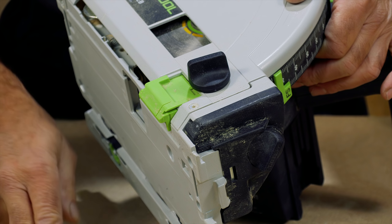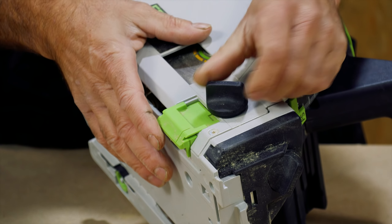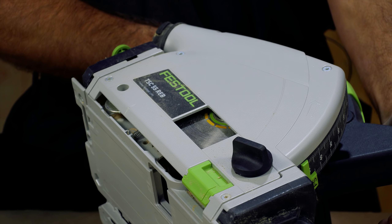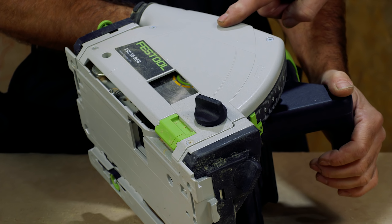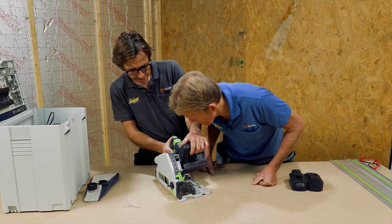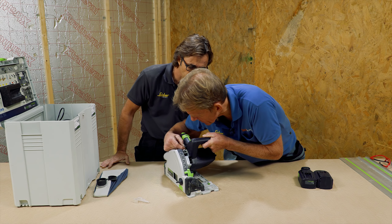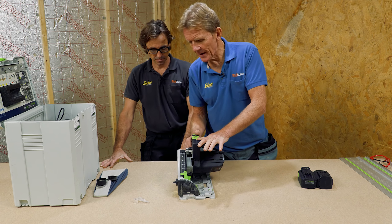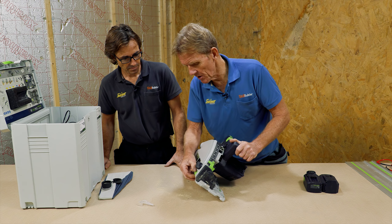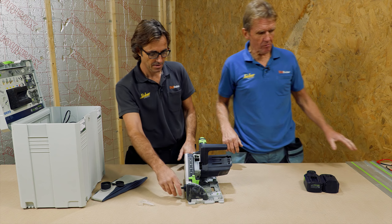There's a splinter guard here - you can take out the vision panel and replace it with this splinter guard, which does a couple of things. Obviously it does what it says on the tin - it guards against splinters. There's another knob which just secures it. When you're on the rail, you can pull that down and it's actually helping you protect both edges of the cut - one that's against the rail and the one that's not. Also it's going to stop your tipping as well. If you've got something you really care about, like a veneered door, and you're really worried about breakout...